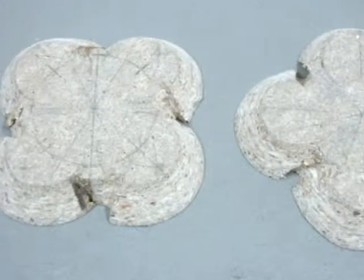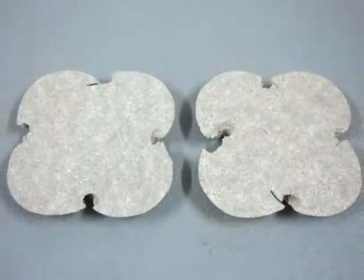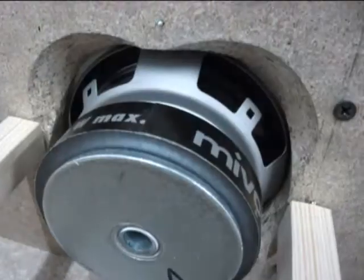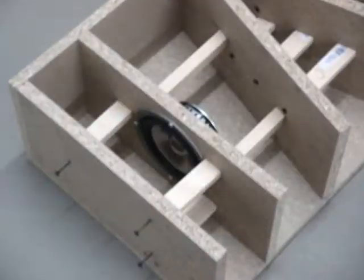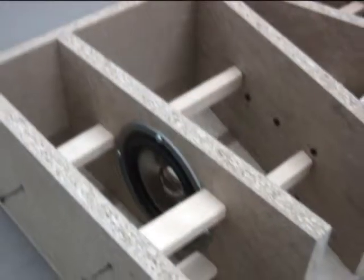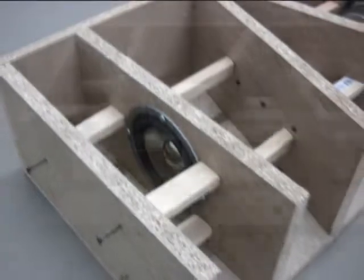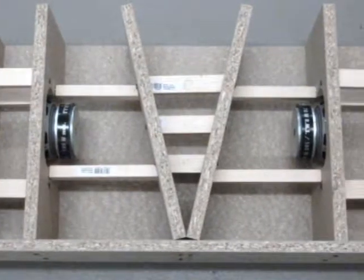For the subwoofer driver, I made a special cutout which leaves the driver very much space to breathe with a nice chamfered edge. The whole subwoofer is a high-pass filtered bandpass, and both drivers are located adjacent to each other, so that the whole subwoofer has impulse compensation.